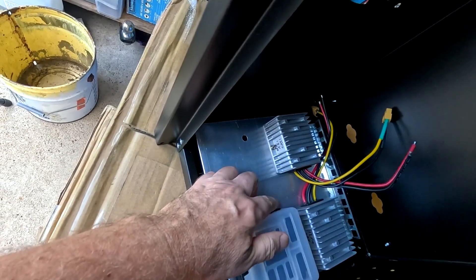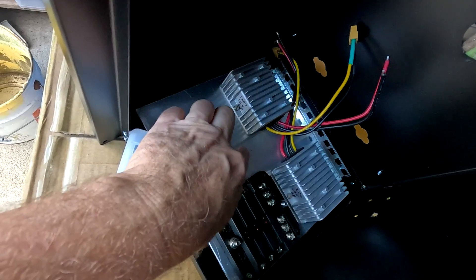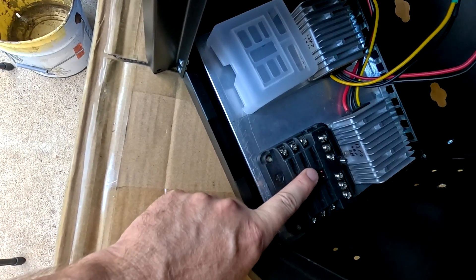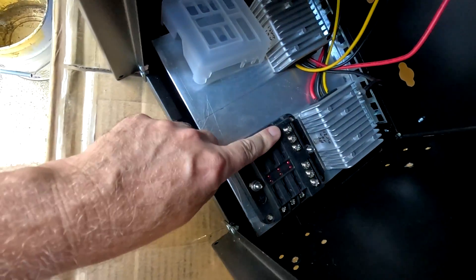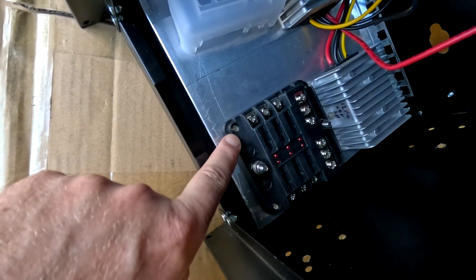That took me a while. I first thought I could mount everything on the plate, cable it up outside the box, then put it all in — but no, some mounting screws are actually underneath the components, which is generally a bad design. I had to put the plate in first. Then I found my drilled holes for the fuse holder were off by four or five millimetres, and the fuse holder isn't square, so I had to rotate it 90 degrees. The buck converter cables are still long enough to reach it. Also, my 10mm screws weren't long enough — needed 16mm — so 15 minutes later everything is done and solid.